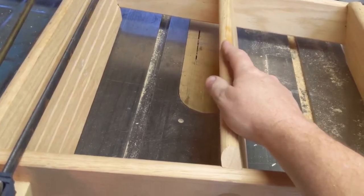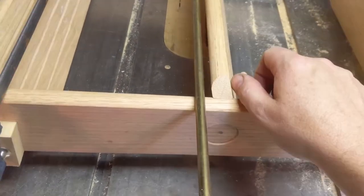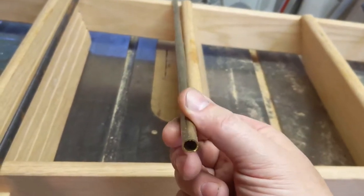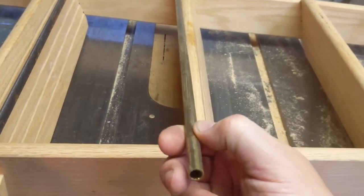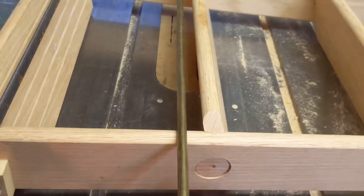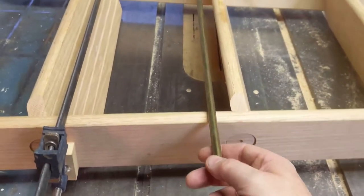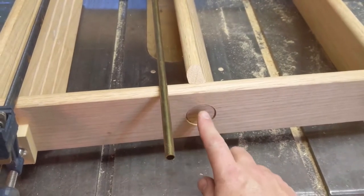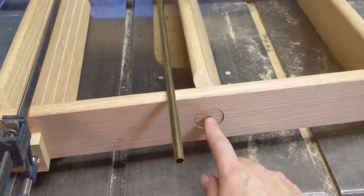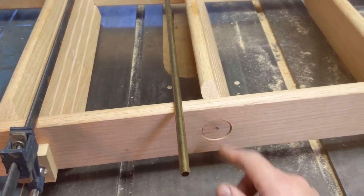The center braces will be glued and screwed, and then I'll install all of the brass tension rods. This is just a brass tube, and the brass tube will be concealing ¼ inch all-thread. The actual tightening factor will be ¼ inch all-thread, but concealed by brass tubing, and then using a brass acorn nut on top of the brass rosette on the outside — so it will be decorative and pretty, but also strong.